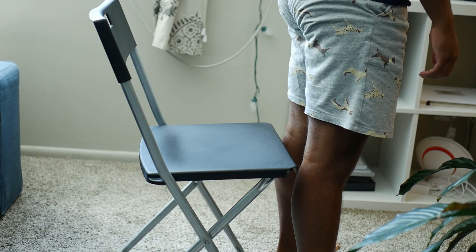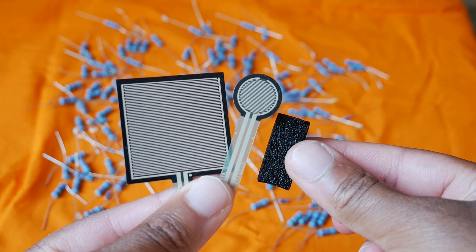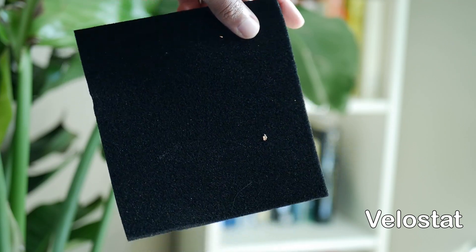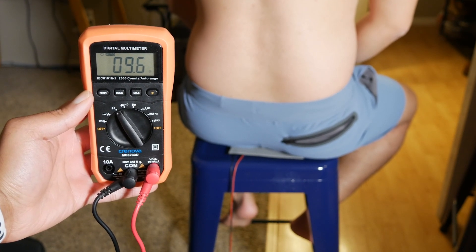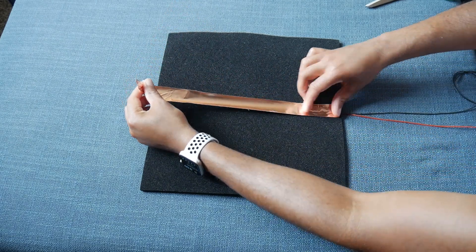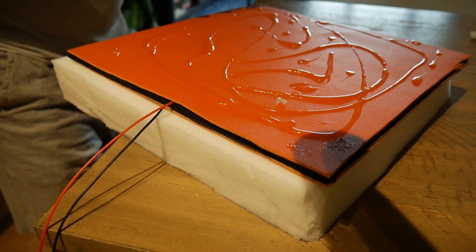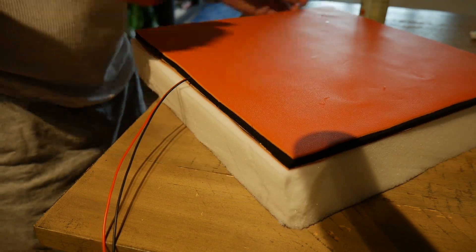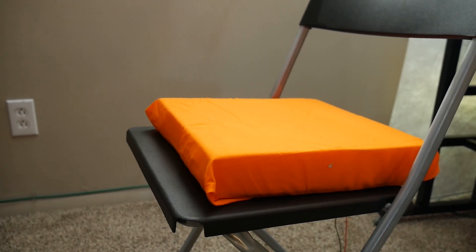So how will we know if somebody is sitting? The easiest way is to use some type of pressure sensor or force-sensitive resistor. I decided to use a material found in lots of packaging called Velostat. It's electrically conductive, but it has a resistance that changes when pressure is applied to it. For the bare minimum setup, we can apply copper tape on both sides of the Velostat and connect a wire to that tape on either side. But since we made this look like an actual cushion, let's add some protection using craft materials and some cushioning using a chunk of memory foam, then wrap it in an obnoxious color.